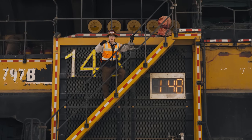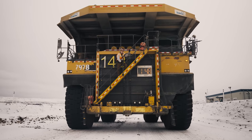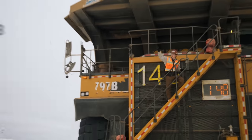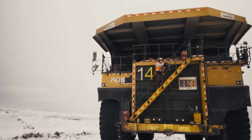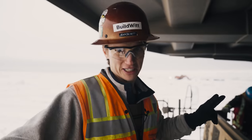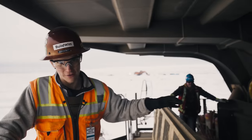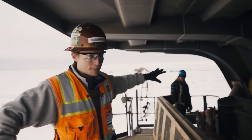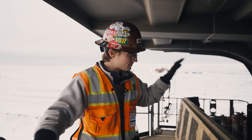And now for the final truck in our big truck segment — the Caterpillar 797B, another 400-ton ultra-class haul truck. This is an absolute legend in the haul truck world. Stats will be on screen. Two key differences from the Komatsu: there's no aftertreatment — this is not Tier 4, so the exhaust goes directly from the power plant into the bed out the back. Also, there's no electrical drive system up here because this is a mechanical drive truck. Komatsus are electric drive; this is mechanical.